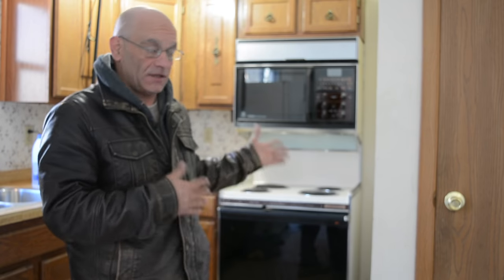We went online and found a used one, which is only a couple of years old. It's very different, and it's probably pretty much the same one that you'd be trying to do yourself. So basically, I checked the circuit on this and I know it's a 40 amp service. So we need to get the newer stove. Now, I probably have to upgrade to a 50 amp. Of course, if we have to do that, our plug, our wire, our breaker — everything is going to have to be changed. So let's get into the technical end on what we have existing and what we're going to put in, to see: do we really need to upgrade to that 50?